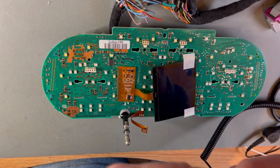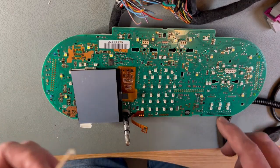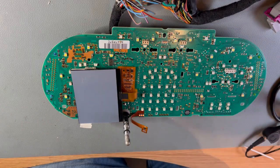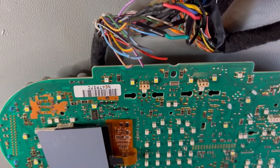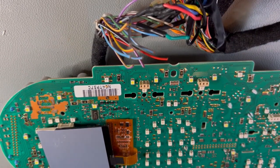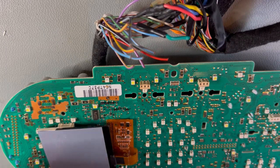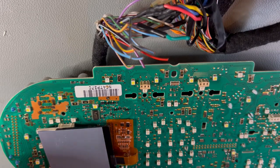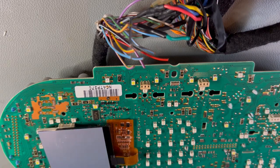I'm going to apply some flux around these surface mount resistors near the top of this display and then resolder them. Hopefully you'll see the solder flow around the ends of those components and remake the joints. Sometimes when you heat up one end, the whole component falls off the board — which tells you for sure that one end had fractured and was not actually making a good connection. In that case, use the tweezers, unsolder both ends, refit the component, and resolder both ends. These bad broken solder joints are pretty common on these TT clusters — these larger resistors tend to be the bigger culprits.